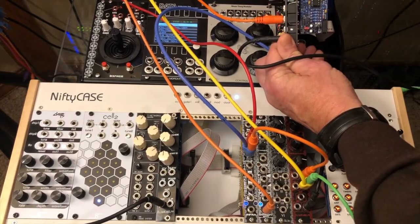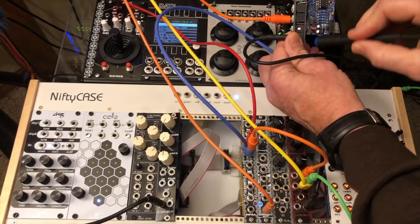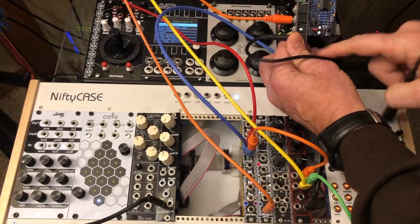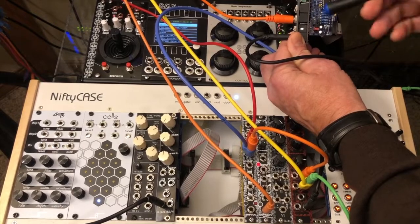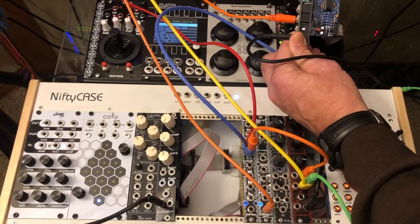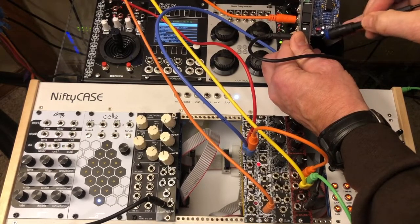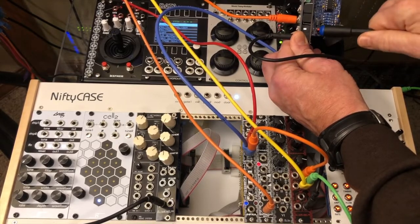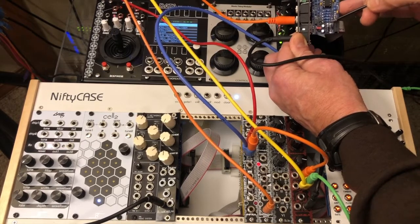So there are 3 jumpers on here. The bottom jumper, the one that's in red, it's on a 2-pin, and right now it's not doing anything. It's not jumpered. It's just sitting on 1 pin. It doesn't matter which pin. And if you wanted it to have lower resonance, more civil behavior, you would actually put that jumper on, so it would be going up and down, right, on this pin and that pin. I have it off because I like the gnarly resonance.